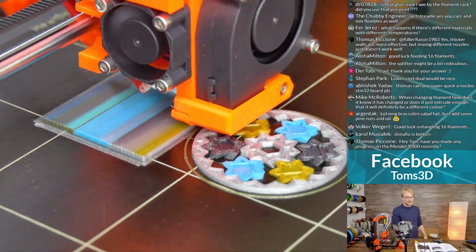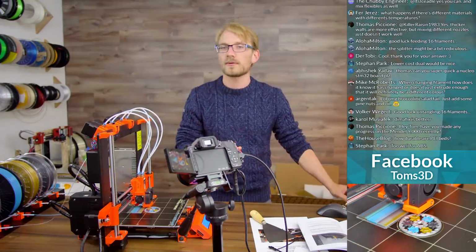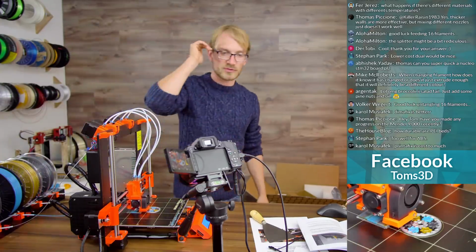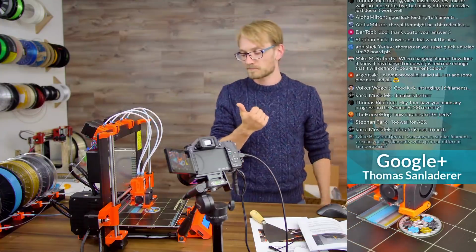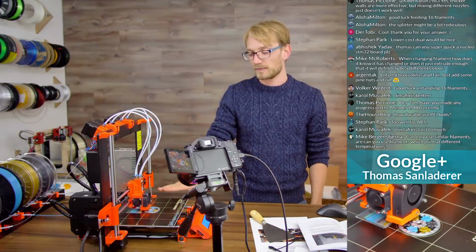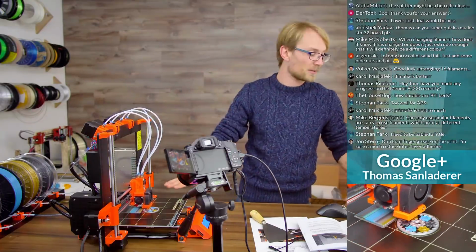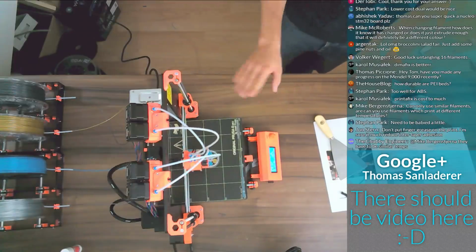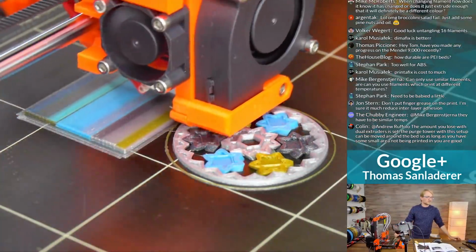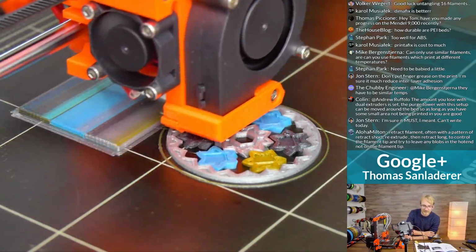And yes, this is actually the glue stick that is included with the Mark II, the Mark IIS, the Mark II Multi-Material. And again, the manual does mention to use it with PETG basically, and flexibles. And that's what it's for. For PLA, they are including some isopropyl alcohol wipes. You just wipe down the PEI bed, and that sticks incredibly well. Don't put finger grease on the bed. If you just smear your fingers over the bed, that area right there is not going to stick well anymore.